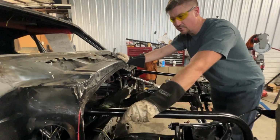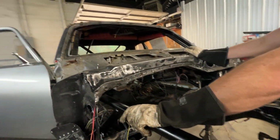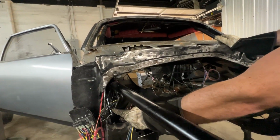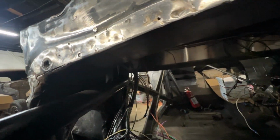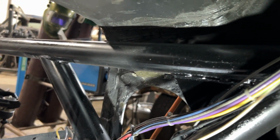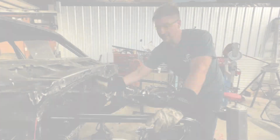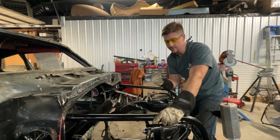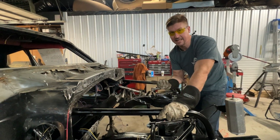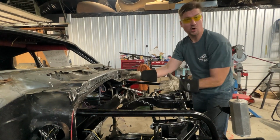These bars here, which we'll call front legs, were not welded up inside. This bar was something we added because of that, and we went up in here and, can you see? Kind of. We'll get some close-ups later. We added a gusset. What that does is, we believe if you hit the wall in a 1,000-plus horsepower automobile going over 100 miles an hour, which this one we'll speculate will do with the 88 millimeter turbo, we don't want this to get loose and become a harpoon.